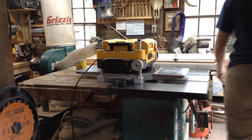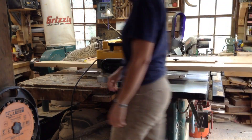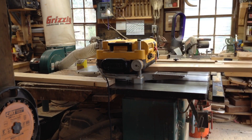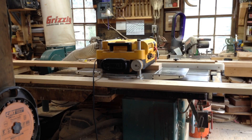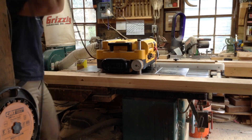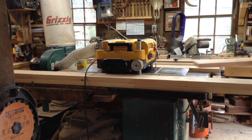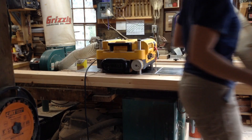The size for this door is based off the wall opening. There is a molding frame around the door, so for the height I went about an inch and a half taller — that's in the directions for the barn door — and about an inch wider on either side than the opening. That came out to about 38 inches total and about 80 and a half inches tall as the final size of this door.